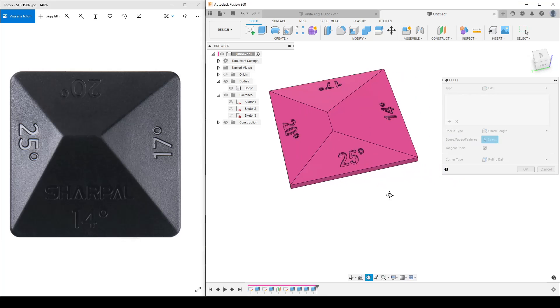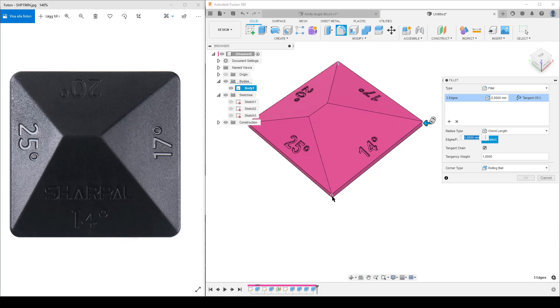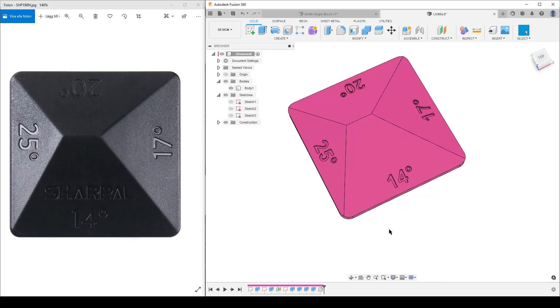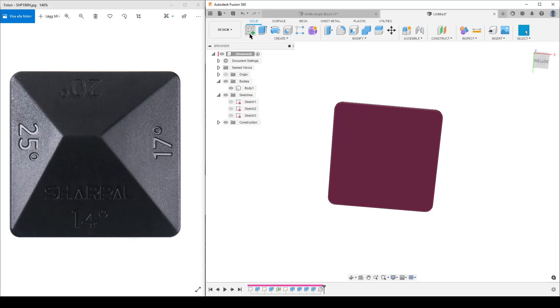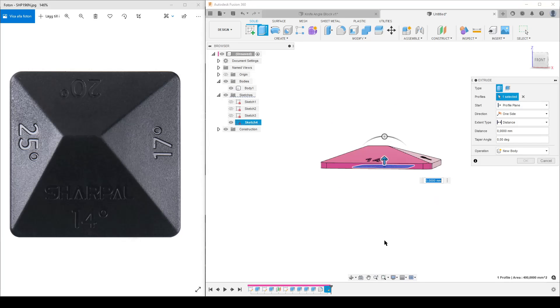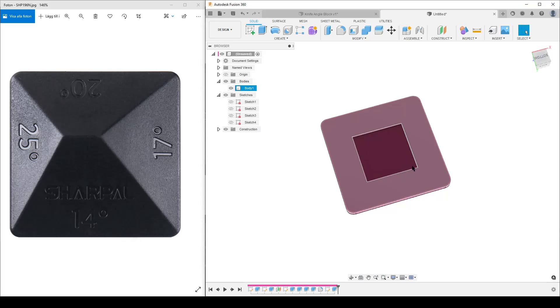The last thing I like to do is add a fillet — hit F, select the sharp corners on the outside edges, give them 4 millimeters. You could fillet all the small sharp edges too, but for 3D printing the printer naturally rounds small edges anyway. Some curved faces can fail with fillet, so this is not a perfect model. On the bottom, if desired, create a sketch and cut a 20×20 center rectangle, extrude 1.5mm up and cut away to add rubber feet or a magnet.